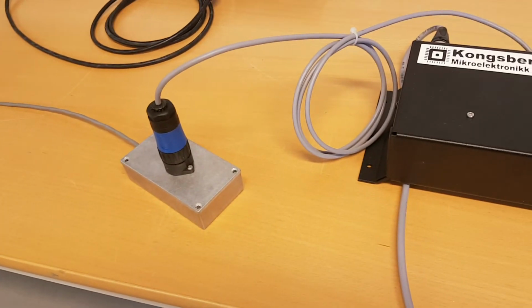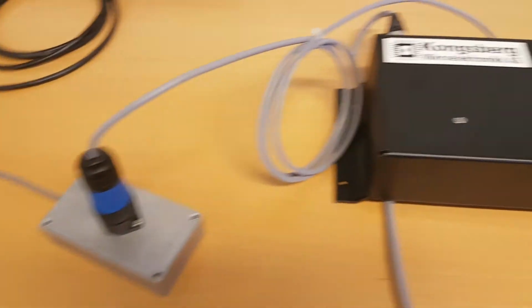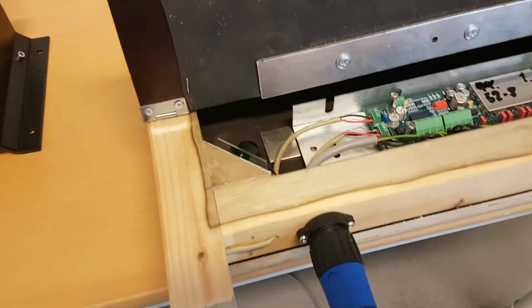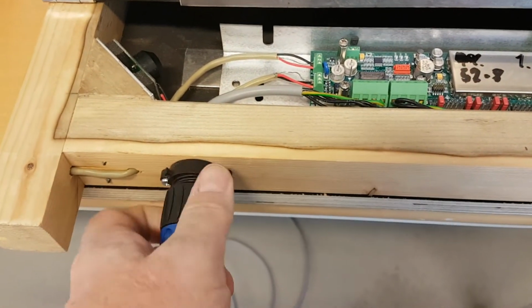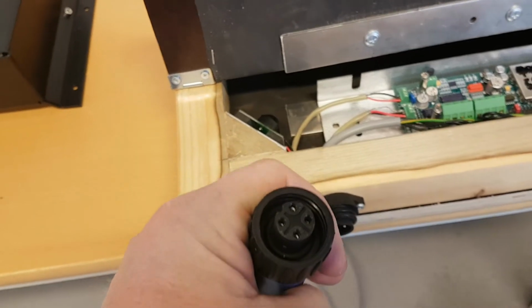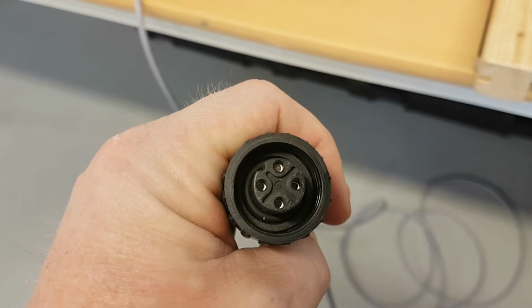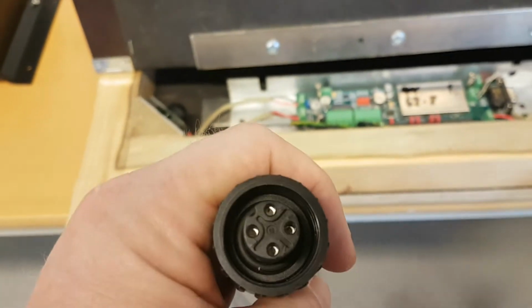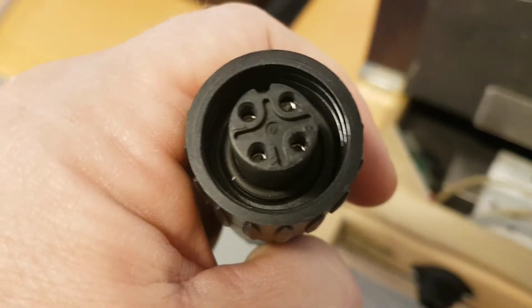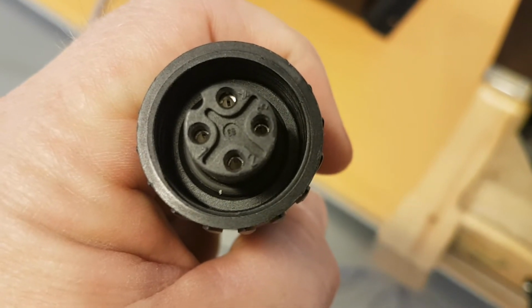Next step will be to introduce the power supply. So I will connect that. We have connected the power supply to the signal cable, and we can move over to the first target, the target server, and then we can remove the ingoing connector there. If you have a system with external target electronics, you will have cable 1 and 2, which is attached by terminals inside the box. On these targets where we have the internal target electronics, we have a connector we know from earlier, and we can see the connection points 1 and 2 again, and the procedure is basically exactly the same.